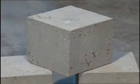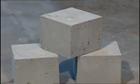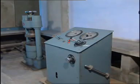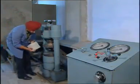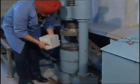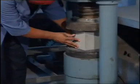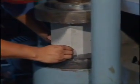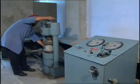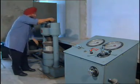The specimen to be tested for compressive strength should be in surface dry condition. This is the compression testing machine where the concrete cubes are tested. The capacity of this machine is 300 tons. For testing the compressive strength of cube, it is centrally placed in the loading unit. The load shall be applied to opposite sides of cubes as cast. The axis of the specimen shall be carefully aligned with the center of thrust of the spherically seated platen.